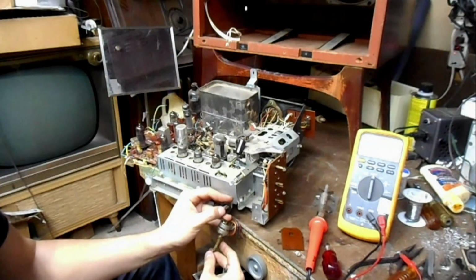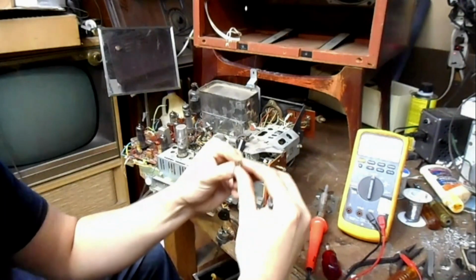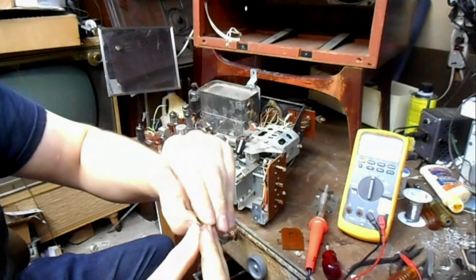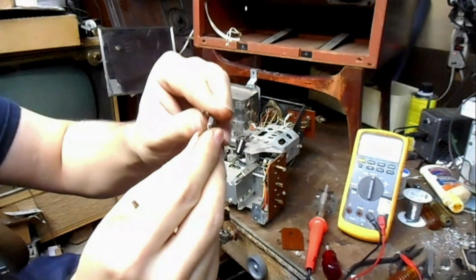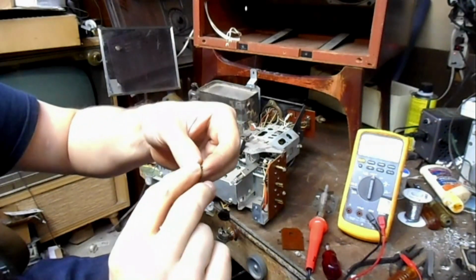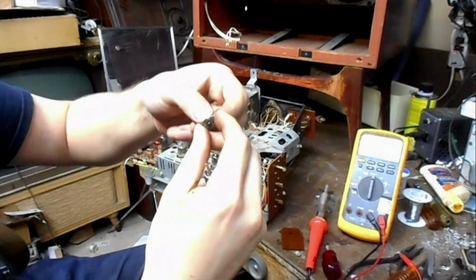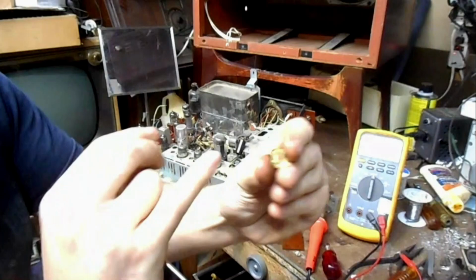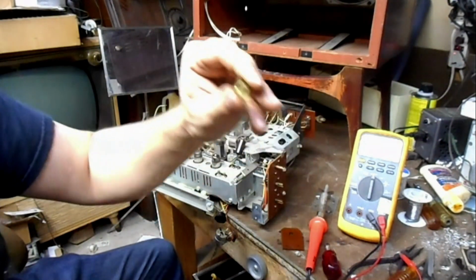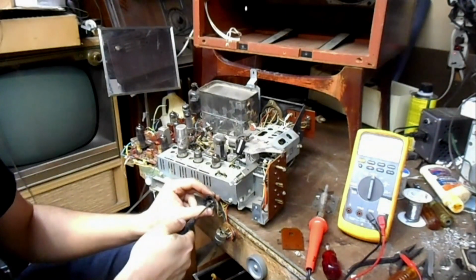The control shaft doesn't push on this center shaft so much as it pushes on this flat plate, which slides within grooves inside the plastic body. When the metal plate slides down, it pushes on the spring, of course, and it engages with the spiral portion of this shaft. And in the course of doing that, as it pushes in, it causes this little cross-shaped insulator to twist. When it twists, it engages these two little catches here and here, and twists this and sort of ratchets it against the little ramps that these 4 patches in here constitute, 2 of which are insulators and 2 of which are the terminals.